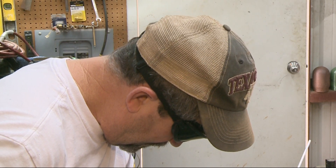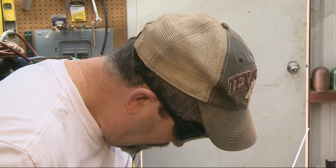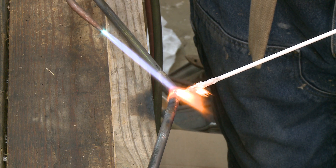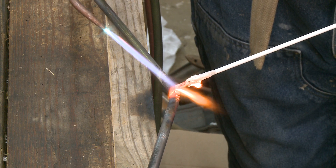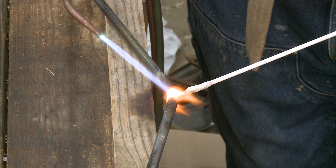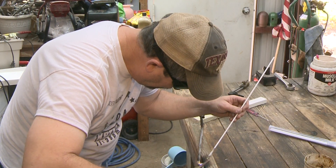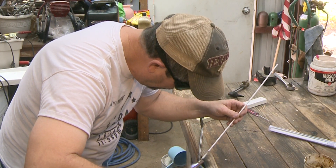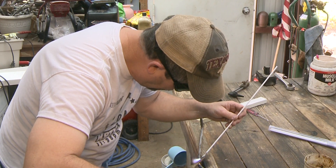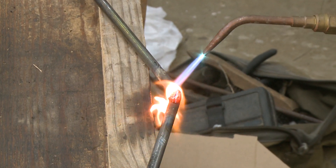You could use a propane torch to heat up your work, but I've got an oxygen-acetylene setup and I was able to put a brazing tip on it, which allows me to control the area I was heating just a little bit more than a propane torch. You don't want the steel you're heating to turn cherry red, because you can actually push your rod through the soft metal. What you want is more of a maroon or dark color in terms of the heat. You know you've got the temperature right because the solder is going to just start melting and it will glide all over the damaged area.